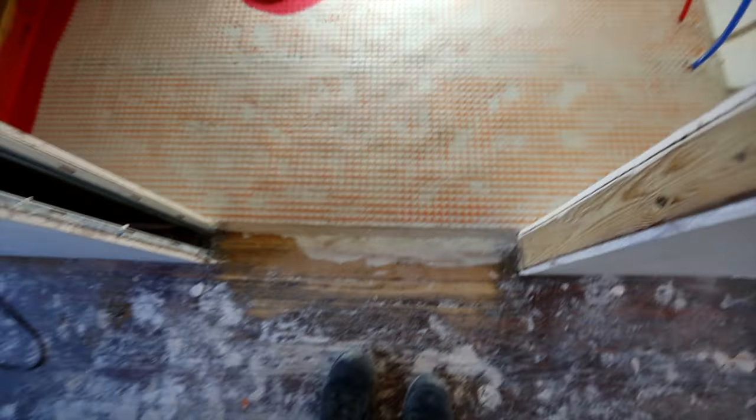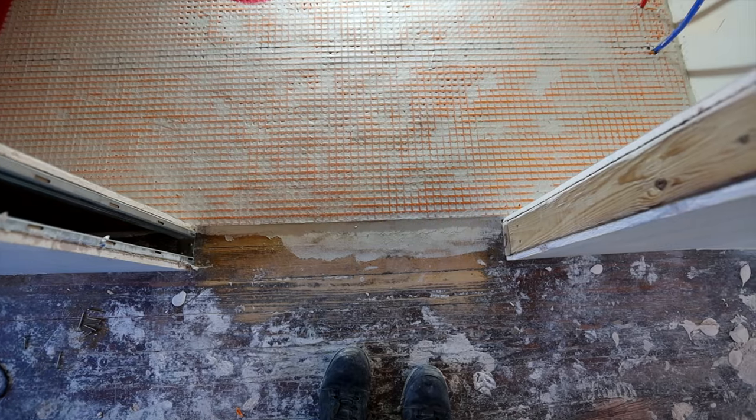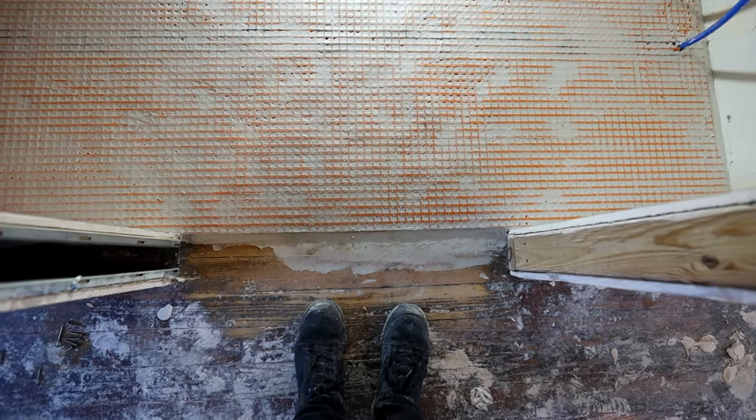This bathroom is 27 square feet — really tiny. I have a sliding pocket door at the front, so I have a threshold to keep in mind, and a shower curb that should be pretty much square to the walls. I don't know if that corner is actually square, so I don't want to start my tile there. By the time I get to the doorway, tiles might look crooked. So for this bathroom, I'm going to start by the threshold of the door and square my tile to that threshold.